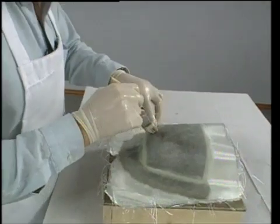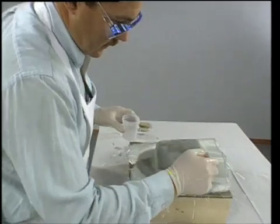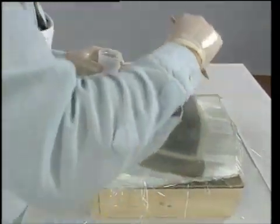Pushing in any of the air bubbles, trying to saturate that out. There are now a total of 12 layers of fiberglass on the mold. The mold half is now completed and will be left alone for about 30 minutes until it is partially cured, but still soft enough to be trimmed with a knife.